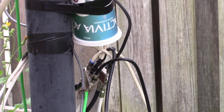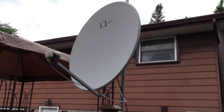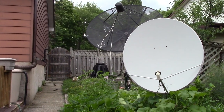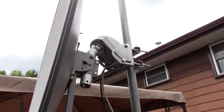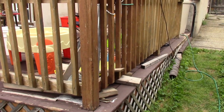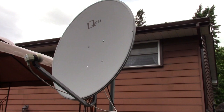Probably the voltage or something about that was causing it to work better that way. One thing I want to mention to people thinking about these other KU band dishes: I'm able to get just as good reception with the KU band dish, or if not better, especially with the four foot dish using KU band — and I was able to get better reception with the four foot dish than with the mesh. But on this one here with the HH motor, I'm going to show you that HH motor that I set up in my previous video. This QSAT dish was just a much easier setup, although this tripod on the deck here is not the best setup.